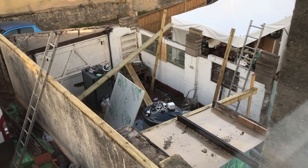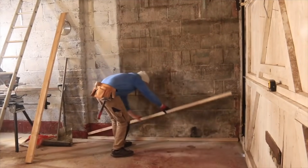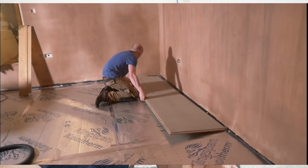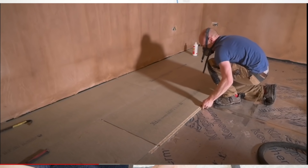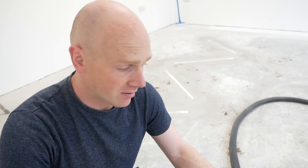Now, when I converted this old garage it was about three years ago, and this room has been through a series of different uses over those years. All I did is put a 100mm floating floor down with a 22mm chipboard finish, and when I did that I painted it with a floor paint just to protect it, but of course we've had plastering going on in here, painting, workshop, glues, all sorts. All of that will show through because we're just using a normal, thin, domestic vinyl.